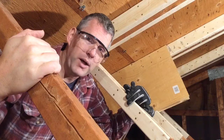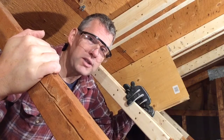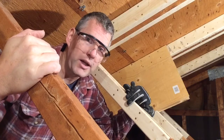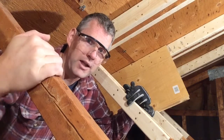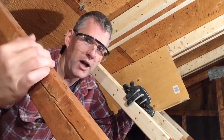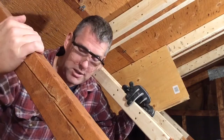If it was a small piece of wood you could do it all at once — put the adhesive on, put it in place, then drill your pilot holes. But this piece is so big that the construction adhesive would start to set up before I get all my clamps in place, and I'd lose the benefit of a really tight clamping system. So I need to do this in two steps. I'm going to show you the jigs I made to help me get two pieces of wood where they need to go.